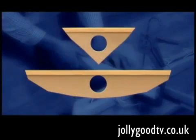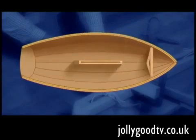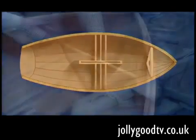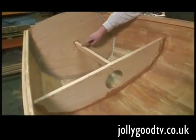Cut any access holes before fitting, as it is far easier to cut them outside the boat. Glue the frames into the boat using a filleting blend with epoxy. Fit the 2 halves of the centre frame each side of the centreboard case and glue in the seat supports. Forward bulkhead, aft bulkhead, with the seat support on the aft bulkhead there.